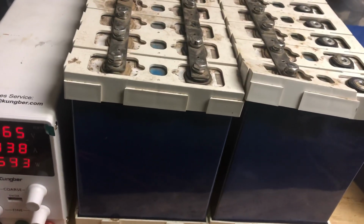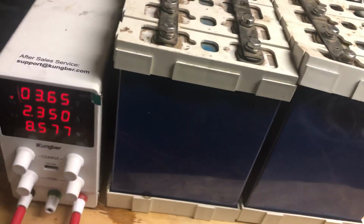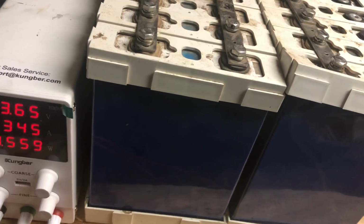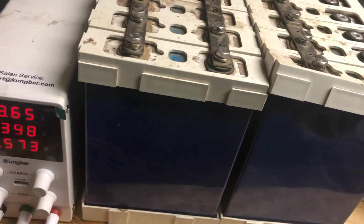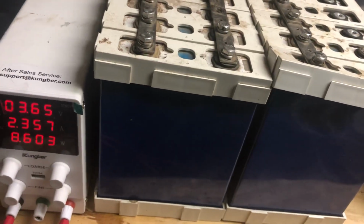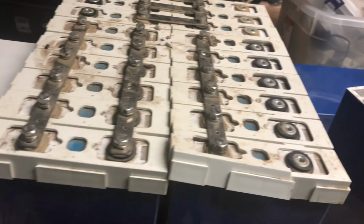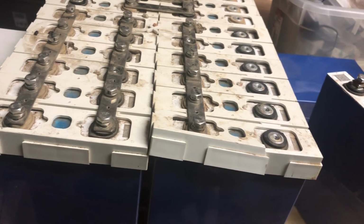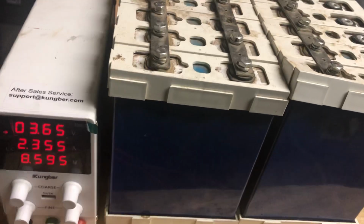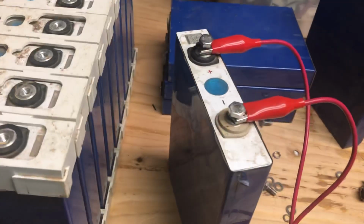Now, of course, lead acid is going to be the cheapest up front, but in the long run, it's actually going to be the most expensive. Lithium ions are a bit more expensive up front. They last a bit longer, and so they are actually cheaper long term than the lead acids. And these ones are still cheaper in the long term than the lithium ions, but cost quite a bit up front. And lithium titanate sort of is the king of amortization, beside even the LiFePO4, as I understand it. But it has the worst upfront cost, and there is the potential for dropping them or causing those crystals inside to shatter. So I think this is a good balance between them, and so did the industry a couple years ago, with Tesla and others making the conversion over to this chemistry.